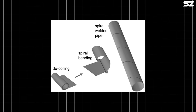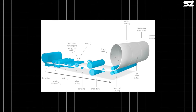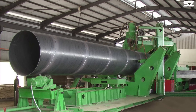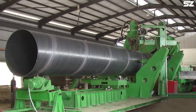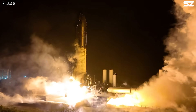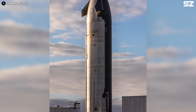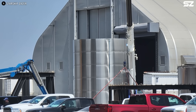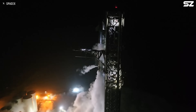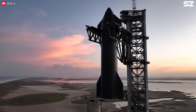An interesting idea is spiral welding — a process involving shaping a flat steel strip into a spiral and welding the seam to form a cylindrical pipe or tube. Commonly used in oil and gas, water, and wastewater industries, it's especially effective for producing large diameter pipes. This technique might also be employed in manufacturing Starship hulls. Spiral welding is a continuous process well suited for automated systems, and it inherently integrates quality control and re-welding for consistent results. Unlike traditional methods constrained by material roll axial length, spiral welding allows production of sections with optimal lengths.